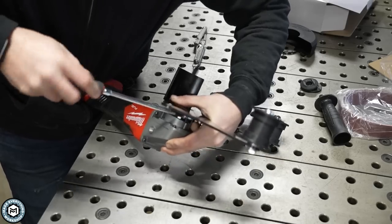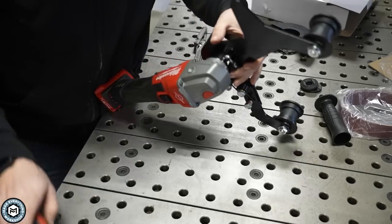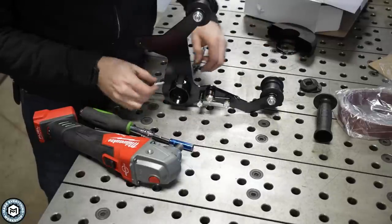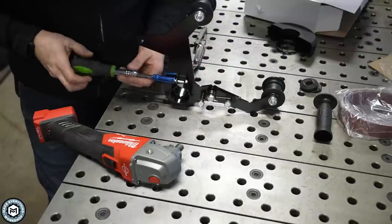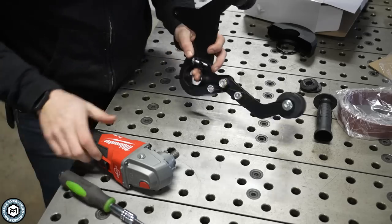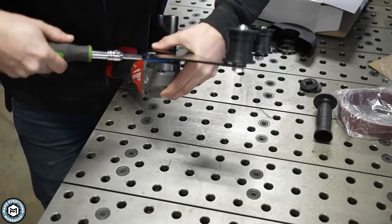If it's loose it's just going to pop off the grinder. The screw is garbage, so it might be harder to make it tight than it should be — it may need to be replaced. On mine, it immediately stripped. It's an M6 by 1, so I'm just going to replace it with a hex head screw. This will do the job and maybe make the clamp a little bit tighter. The other one I have, the screw wasn't so crappy and it worked out really well.